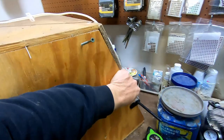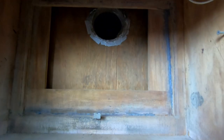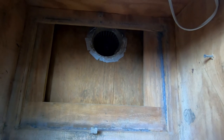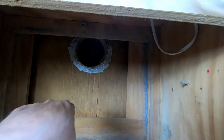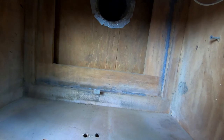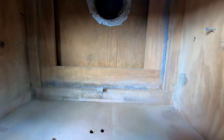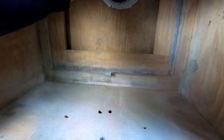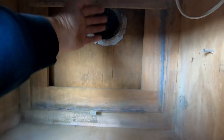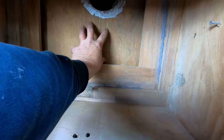Back at the front view — what I would change on this build: looking up into the back, I've got that squirrel cage fan too high. That fan should be sitting right there, lower. When you're spraying paint, you're spraying it directly into it, even more so into the bottom of it. That's what I've been doing today — cleaning off stuff that collects on the back. It would be much better lower, because as you're spraying, it's pulling that overspray and fumes up into the squirrel cage fan, and if you're doing a lot of volume it'll start to roll back over.